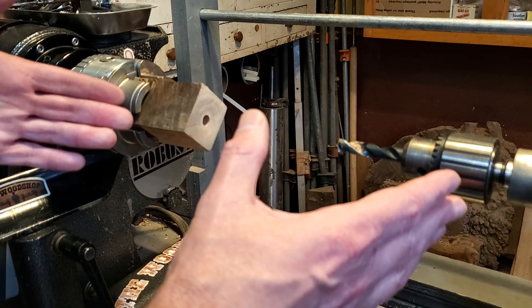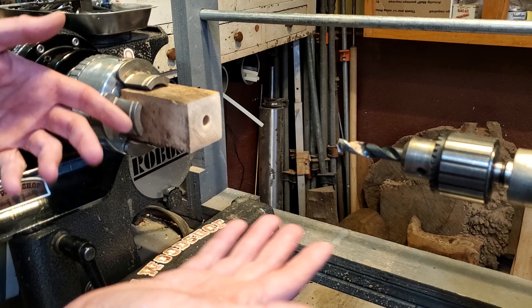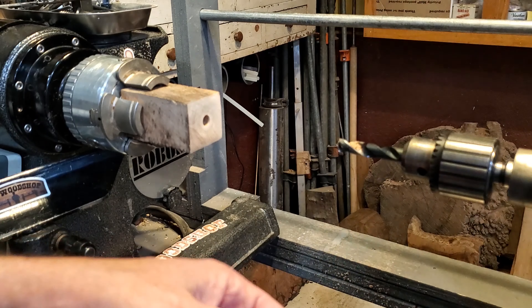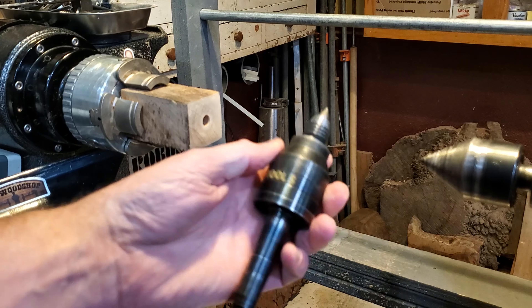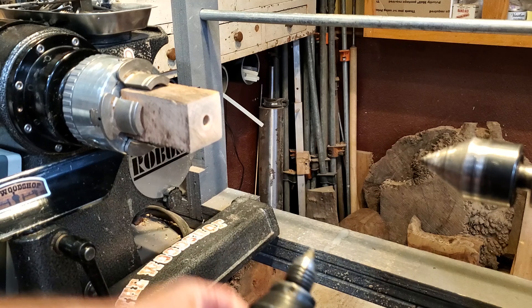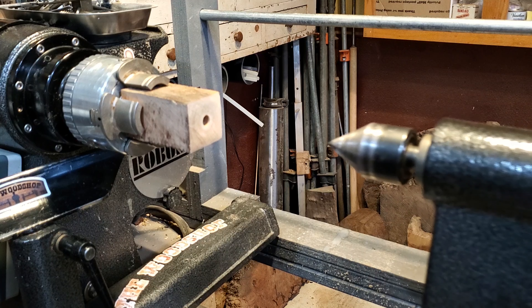It works really well. You can do it with the drill press; I normally do it on the lathe. I'll drill the holes with the drill press for a batch of blanks — it's a lot faster — then bring them all over to the lathe and press them in. I have a cone-shaped live center like this. If you don't have one, you can take a regular live center and slide the point out a little bit, but the cone shape just works better. Slide the tail stock up and lock it down.